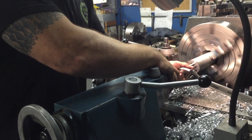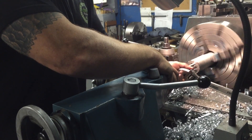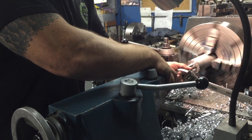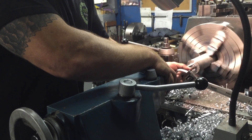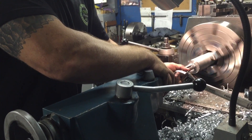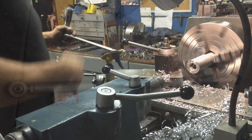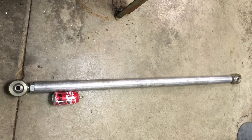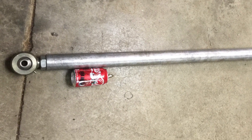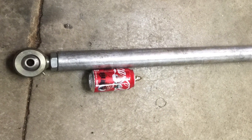It's really not fixed to anything. As soon as it gets to the end, you'll see me pull the tailstock and pull the tap back out. Because the tailstock's not locked down, it's actually pushing the tap back out — so it's pretty safe, not going anywhere with that crescent wrench. And we are done. Do both sides and you end up with this finished part. I threw a soda can down there for a size comparison. Again, that's solid 7075 aluminum with some heavy-duty Heim joints.